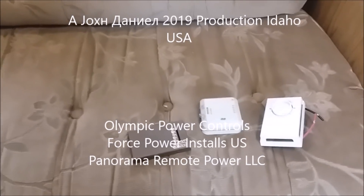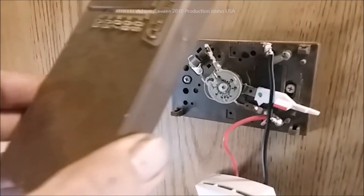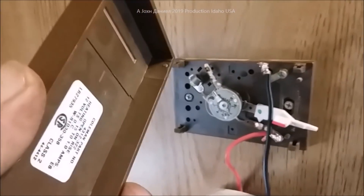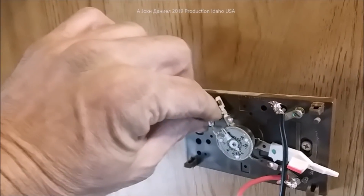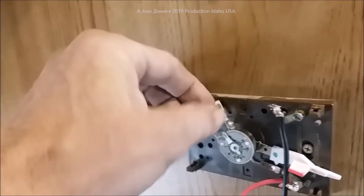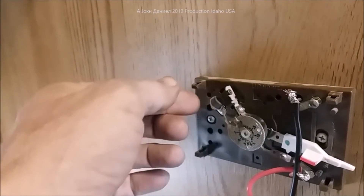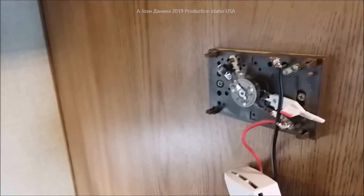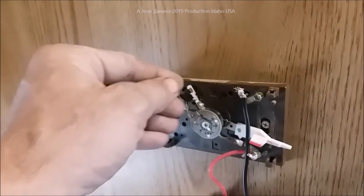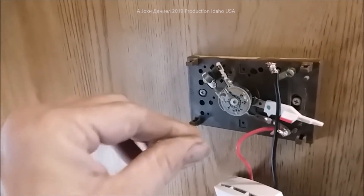I'm in my RV and the original thermostat in here is terrible — about as accurate as a hand grenade. It's really aggravating that the contacts have to be constantly cleaned because they corrode, and the thermostat doesn't hold well. When the furnace kicks on and it arcs, it'll push the contact back off. A lot of people wonder why their heater isn't working, but the contact isn't getting enough power through to make the relay fully close, so the thermostat doesn't cycle properly.